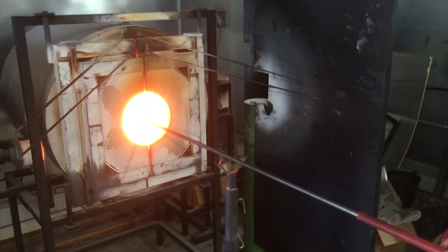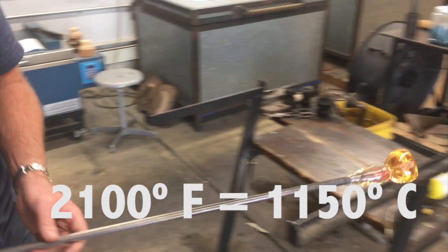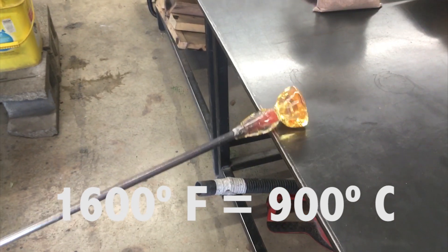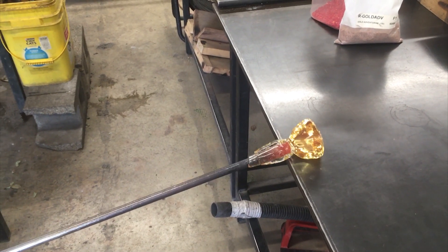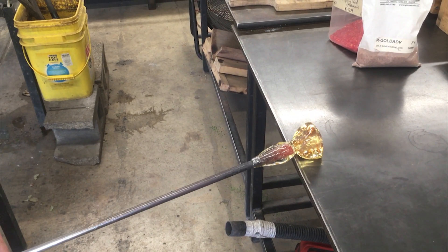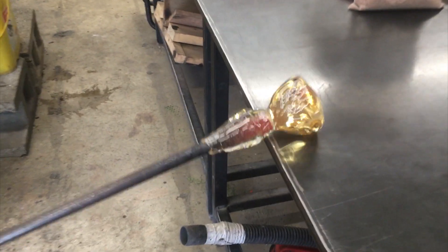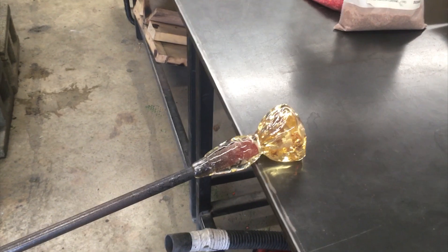So I went looking for the hottest place in town — Paul was seeking out the hottest place in Valparaiso. It's about 2,100 degrees inside the reheating furnace. The glass is starting to glow orange, so the glass right now is probably about 1,600 degrees. It's being shaped into a square cube. As it cools over about 45 seconds, it will lose the amber color, telling us it's losing heat. Once it stops moving, it'll still be about 1,200 degrees.